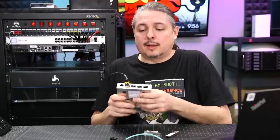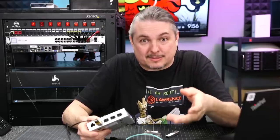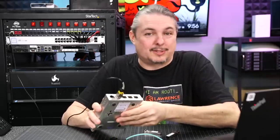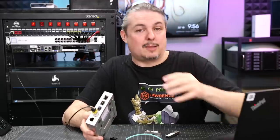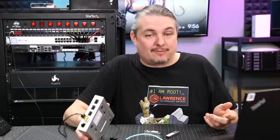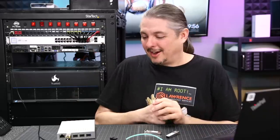A question that's come up: do you need Cat6 to run 10 gig? I know what the recommended specs are — and I have a wonderful interview with someone who writes the specs if you want to dive deep. You can actually do 10 gig over Cat5e over short distances — it's not recommended and I would never do it in production, but the cable in my office wall is Cat5e at about 25 feet and it's been connected at 10 gig for over a year without any issues or drops. I do highly recommend Cat6 for clients and production work — you don't want to be chasing your tail sorting out cable issues.